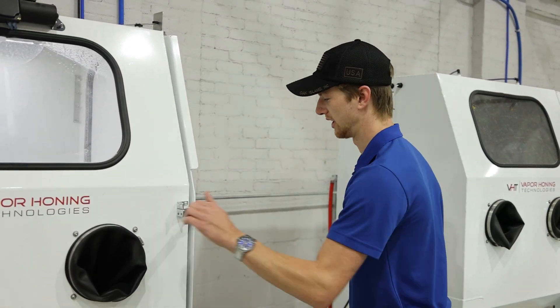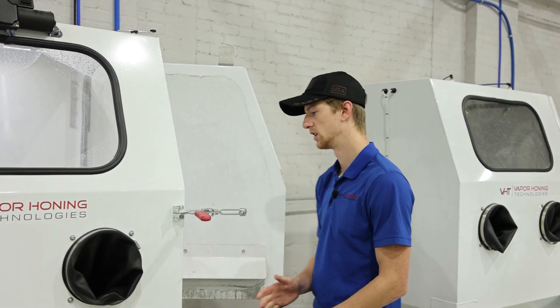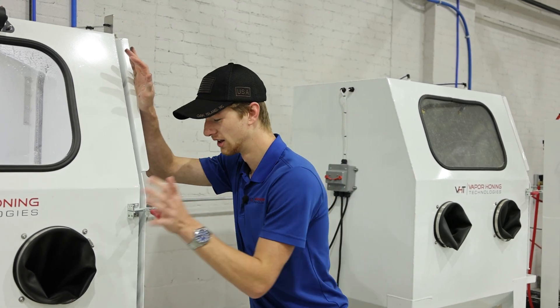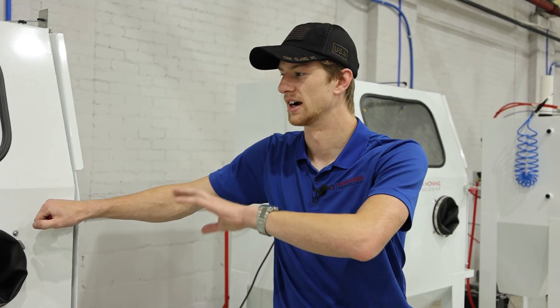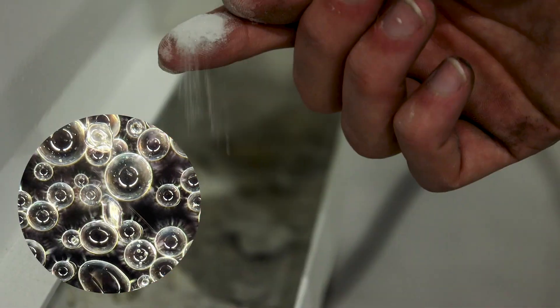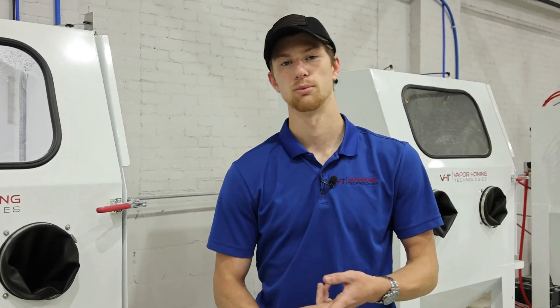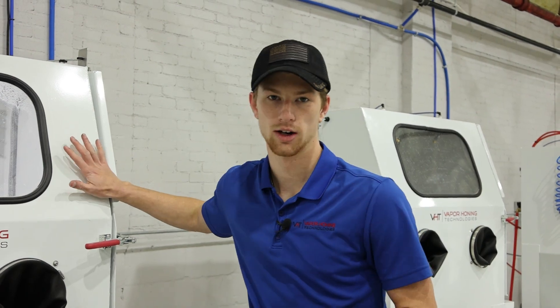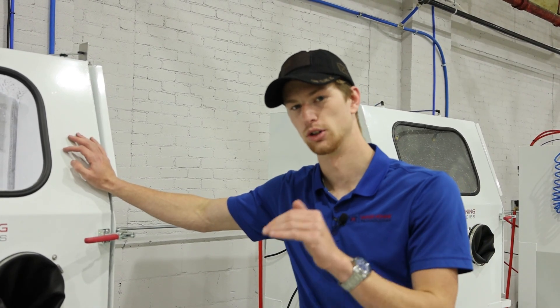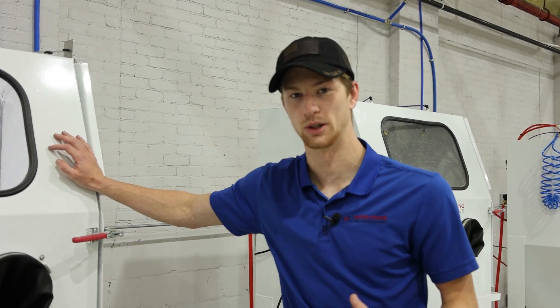To actually blast this part I'm going to be using the VH1000 here. If you guys aren't familiar with what this is, this is a wet blasting machine, also known as vapor blasting, vapor honing, liquid honing, aqua blasting — literally way too many names. It's very similar in concept to sandblasting. You have a small abrasive — it looks like a powder but this is actually a glass bead — and it's going to impact our part, strip off all that carbon, strip off all that grease and grime. Since we have water in this process, it allows the abrasive to hit at a much lower impact velocity, which just smooths the surface and leaves us with a really nice polished finish.